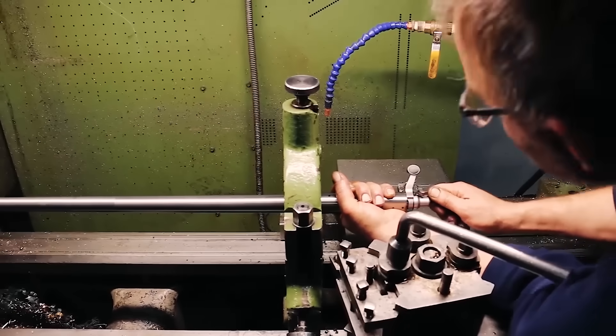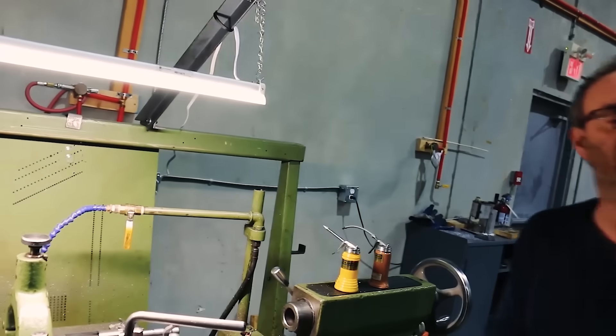We can do cuts for threaded muzzles as well. When we chamber a barrel, all the reamers we use are match reamers. Customers can specify a different reamer if they prefer, but depending on the type of barrel, we like to use match reamers as much as we can because it gives you the most accurate chamber you can get. The match reamers are also matched to the most common bullets. We've tried to match up the reamers to the bullets that people use and take into account magazine length, because a lot of guys want to run them out of a magazine. If you have too much free bore, the bullets are going to have to go out too far to hit the lands and grooves, and then they may not fit in the magazine. We try to take all of that into account when we're chambering them.